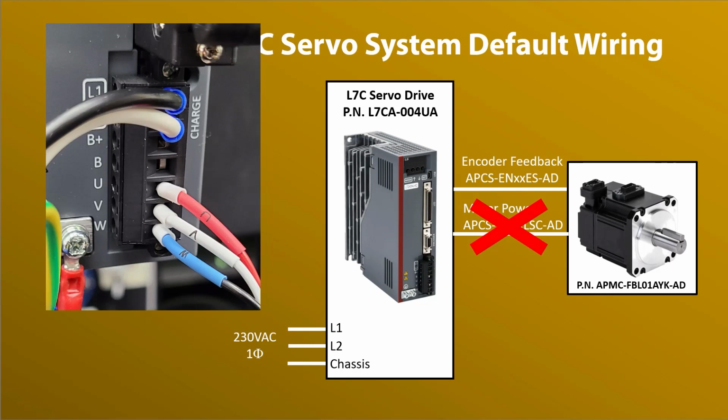Now we aren't connected to a machine in this demo, so I went ahead and connected the motor power. We don't have a braking motor here, but if we did, it would be another keyed connector on a motor, and the brake wires would go to a digital output on the I/O connector that you configure to control the motor braking, usually through a relay or a contactor.